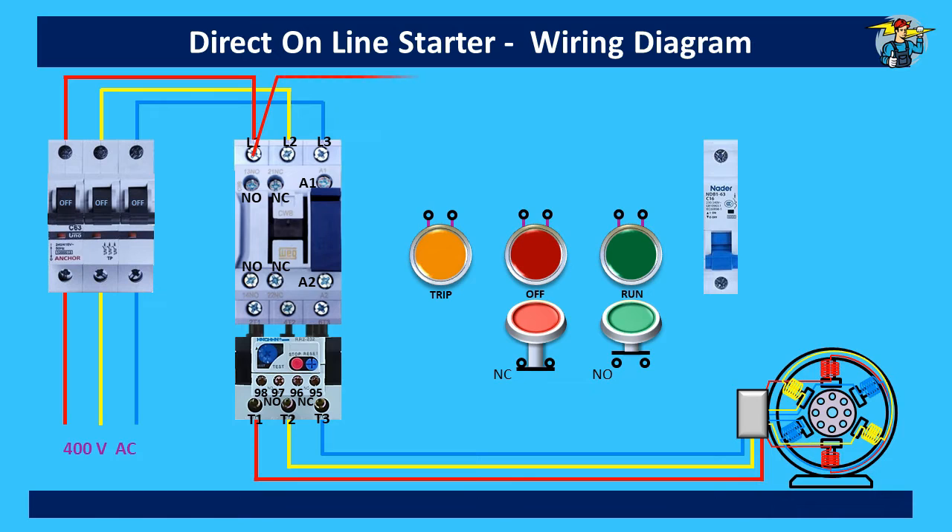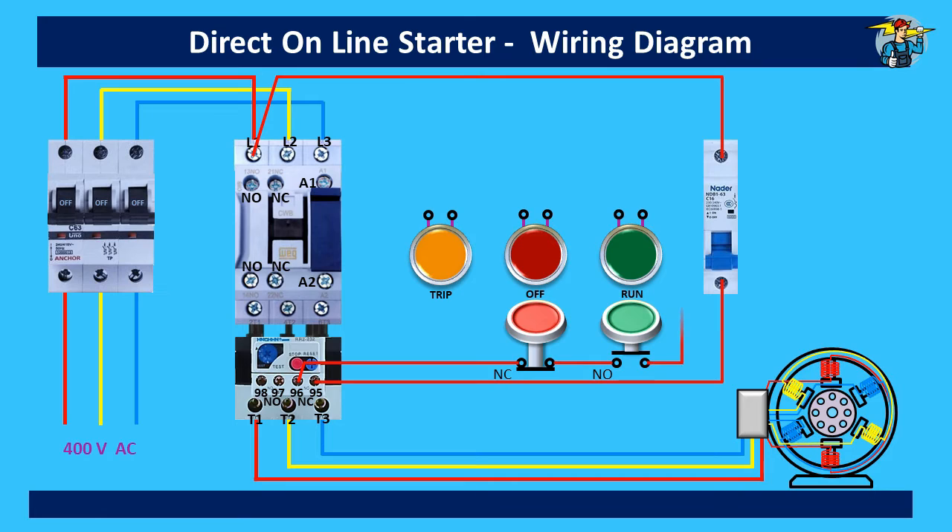Now take one phase wire from the contactor top to the control circuit MCB and through it to terminal 95 of the normally closed contact point on the overload relay. As a general rule, odd-numbered terminals are considered as power inlet terminals and even numbers are given to the outlet terminal. We take the control circuit wire through this normally closed contact point to make sure the line is broken from here if the motor is at fault. From outlet point number 96, wire is connected to the stop push button, and from there the normally open start push button gets this connection. The line is then connected to the A1 end of the contactor operating coil; the A2 end is to be connected to the neutral line.